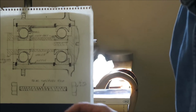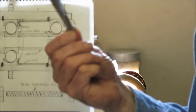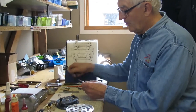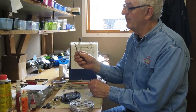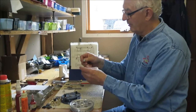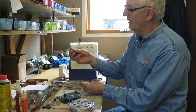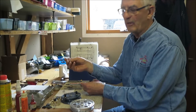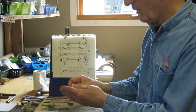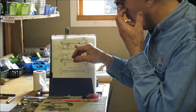You'll need one or two simple tools to be able to do this. I find tweezers useful, a couple of small screwdrivers, and from the local hardware store just a screw — a countersunk number eight by 32 threads per inch machine screw and a nut that fits it. That's what we use for compressing the spring when we're taking it apart.